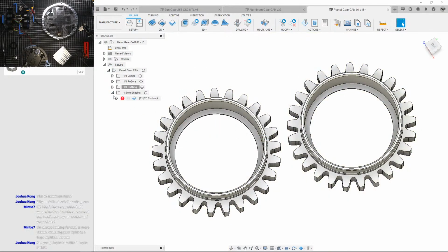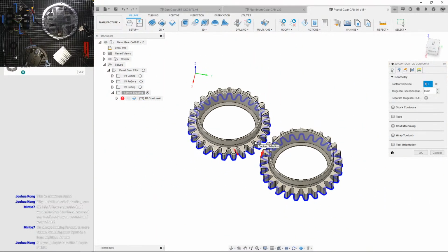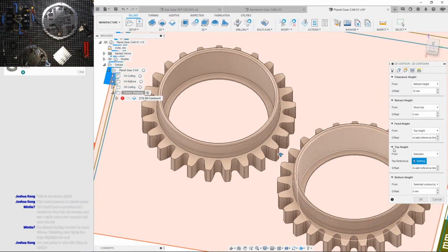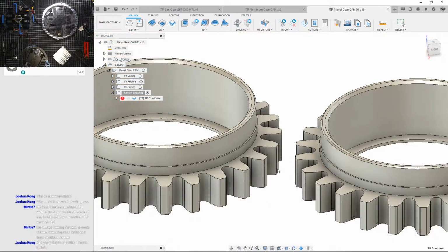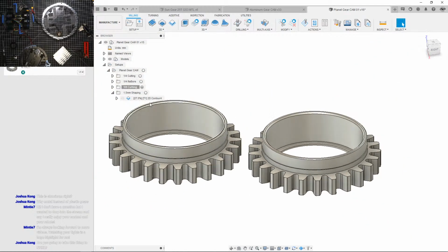Yep. Geometry. Alright. Let's fix it. There we go. Oh, okay, let's have it start up here. And exit contours. 2.3, because I'm really stretching the length of the flute here. The tool is only 6 millimeters long, and that's like 5.75 millimeters. Okay, wait a second.